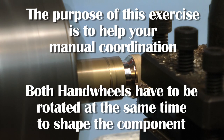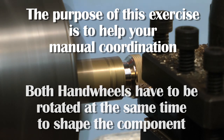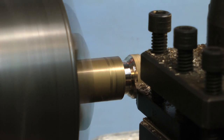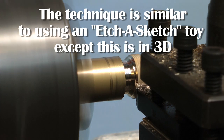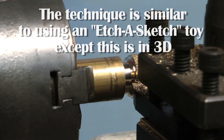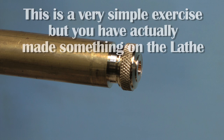So now we have a knurled bar with a nicely smooth edge. Change the tool from the knife tool to a V-tool and work at the other end of the knurl. If the lathe starts chattering, you're taking too deep a cut — back off. What we're doing here is just having a general play, getting used to the feel of the lathe and learning how to operate two handwheels simultaneously — very much like the old Etch-a-Sketch toy from the 60s.